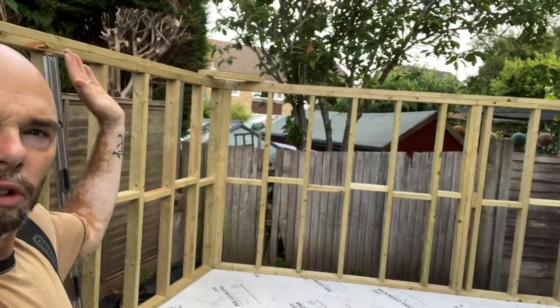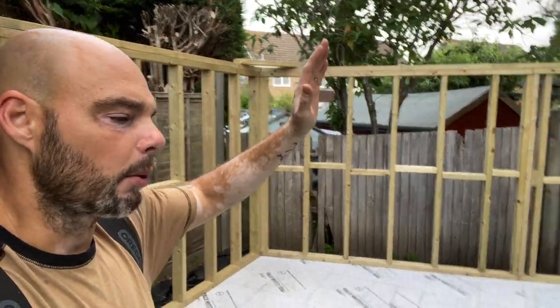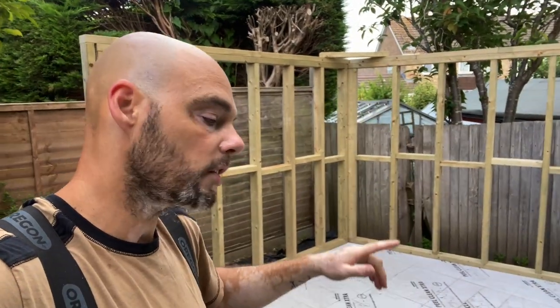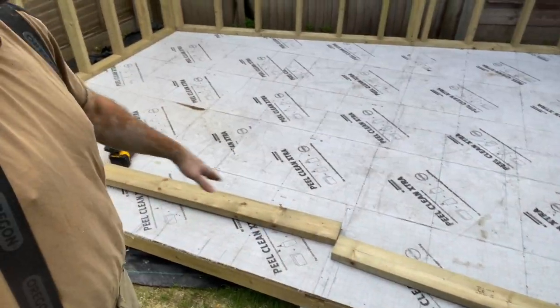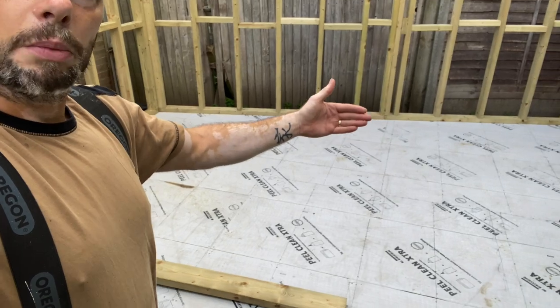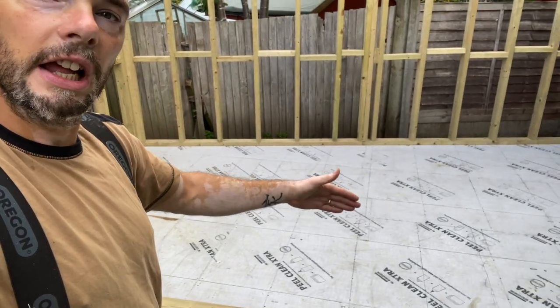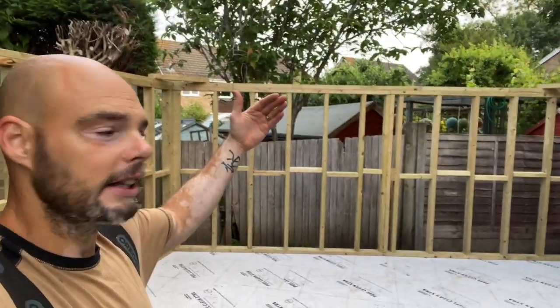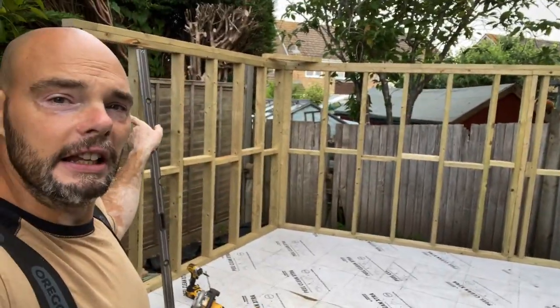You're going to have to put something across the head anyway to brace it and support it and keep it in place before the steel turns up or you get your OSB3 on the front. So what I find is it's easier just to put the base in, turn it aside and build the stud walls like I normally would to the measurements. That way, it's a lot more rigid. I can just raise that one wall up into place, secure it both ends, level it, and that's it.